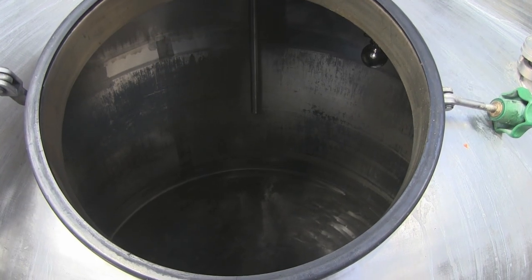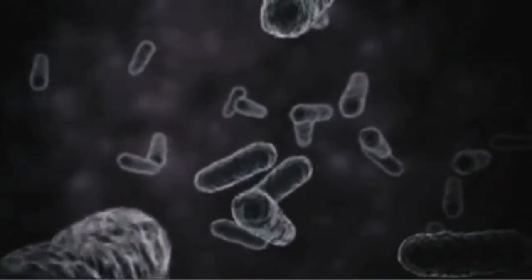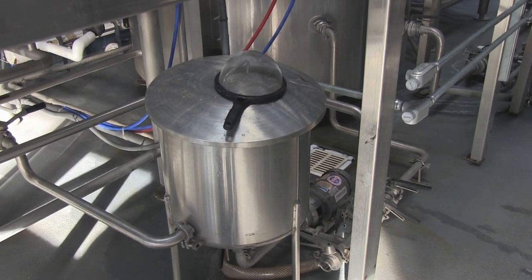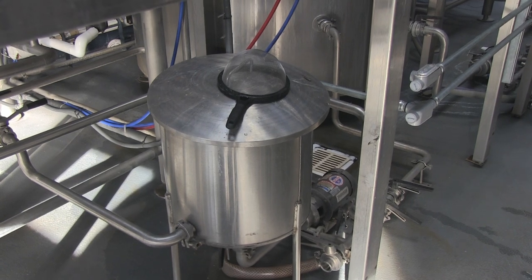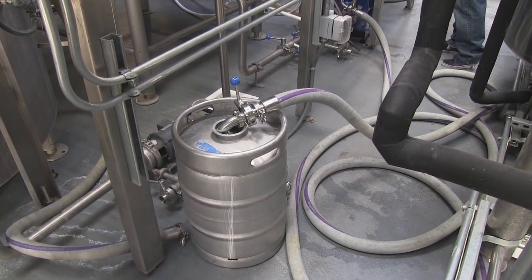After that heat exchanger, you'll still have heat to pasteurize or sterilize the lines before then. However, we still keep them very clean and sanitary at all points. That's the very, very critical point. You have a solution that's ideal for microorganisms to thrive, such as yeast, and you have a temperature in which they can survive and thrive. So we go through a lot. We clean the tanks with a lot of chemical cycles, rotating different kinds of chemicals, and sanitize an excessive amount, but it's better to go too much than too little on that.